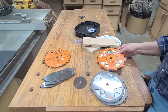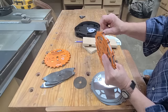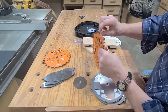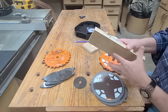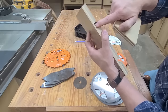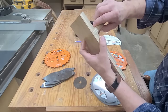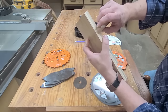Another interesting thing is the way these teeth are designed. One tooth has a bevel going one direction so it scores the outside of the cut, and then the flat one cleans it out — scores it, cleans it out. This actually produces a much flatter bottom cut than my old dado stack. With my old dado stack you can see those little bat ears in the corner, which are necessary to score the veneer so it doesn't tear out, but they can be quite noticeable. On a piece of fine furniture that can actually show from a distance.